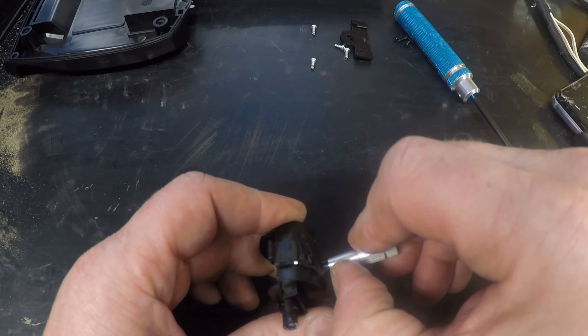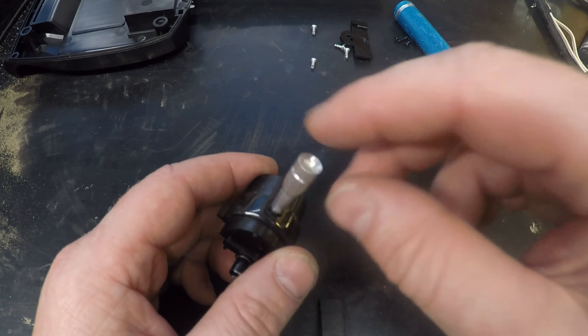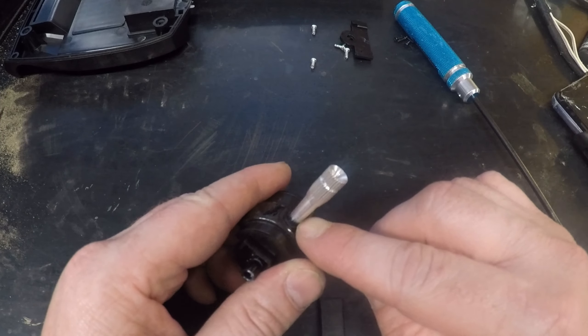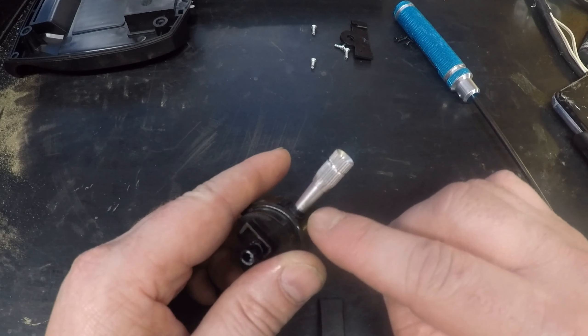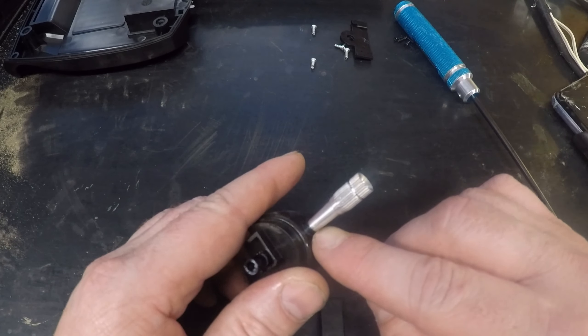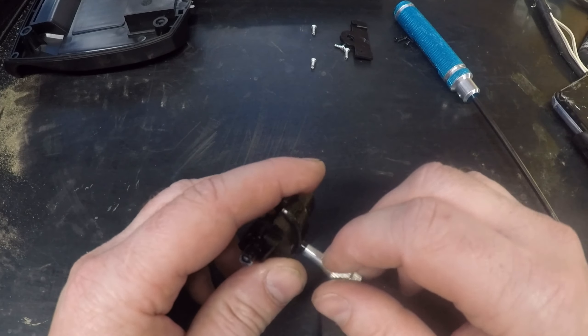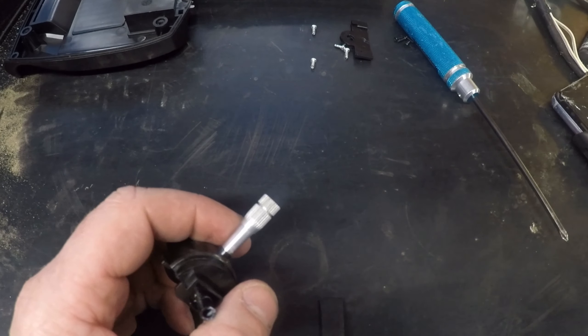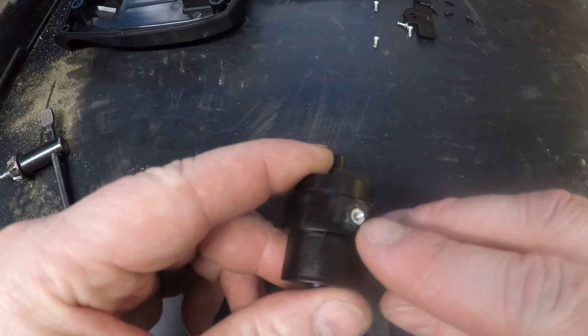As you can see, this is actually glued in here — not very good. So what I'm actually gonna do is just cut it off there. We will then drill and tap to put an M3 screw in there, or an M3 grub screw, quite a long one. Then we'll do the same — cut this down, put a thread on there, and it goes in there.